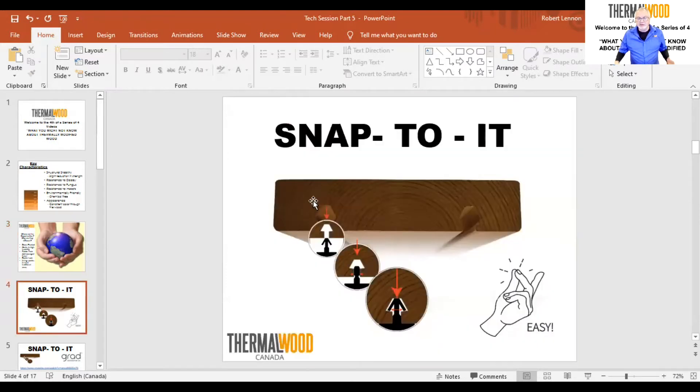Today it's all about decking, and we're going to talk a lot about fastening systems. Decking boards are decking boards — you can get them in ash or pine; they're the best performers. We've tried other species like maple and birch, and while they work very well as a siding product, on a horizontal decking surface they do not work well — you get a lot of surface checking within a short period of time. Ash has proven itself over years of experience in all kinds of temperatures from plus 30 to minus 40°C, and white ash that's been thermally modified still performs very, very well for exterior applications.